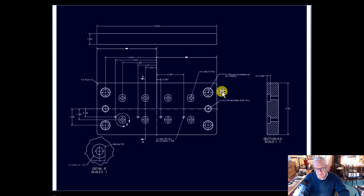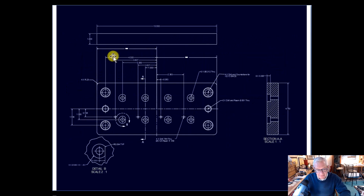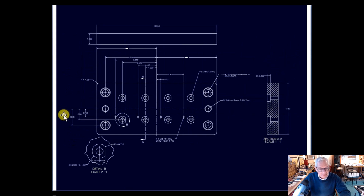I know that's a 17/32nds drill for clearance and a 0.780-diameter by 0.530-deep counterbore. We've got two half-inch dowel pins that he wants a 0.501 through slip fit — this is what will mount right to our machines, our machines have this pattern on them. There are also some eighth-inch dowel pin holes we'll get to in a second. Here's what I do for myself: I clean up the drawing with ordinate dimensions. For me it's just easier to read that way — I pick out the center and measure everything.